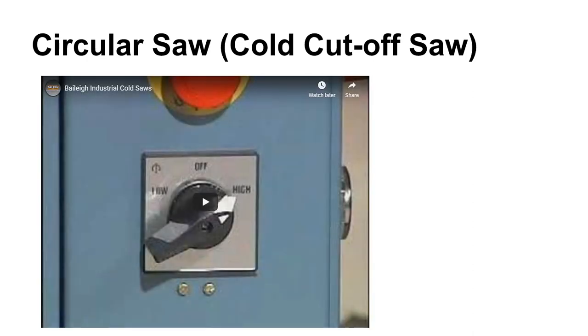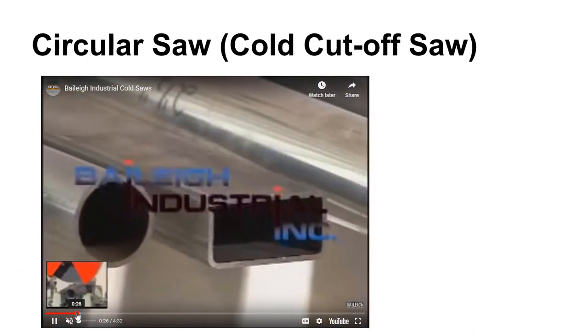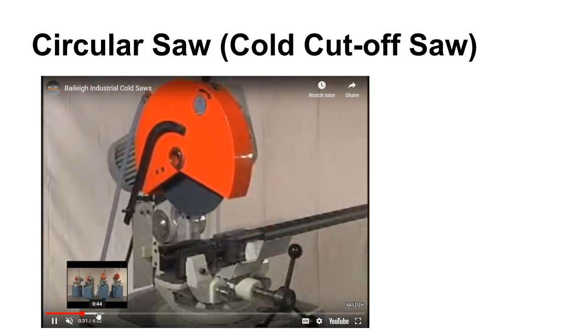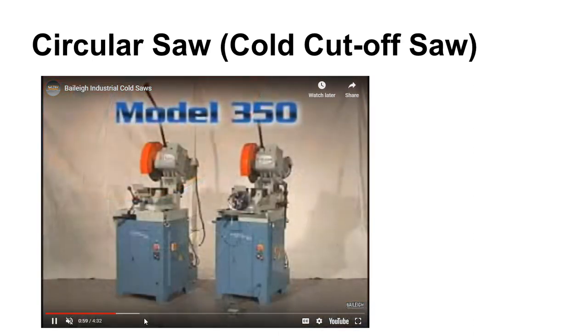Number one disadvantage is slow, because of this non-continuous reciprocating motion. Also, a problem is that you only supported the blade out on the ends, so you had to have a fairly thick blade to not bend and flex under the unsupported section in the middle under load. Ideally, you'd be fixturing the blade right up close to where you're doing the cutting.